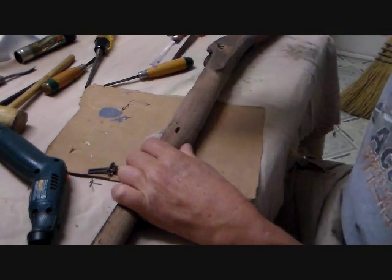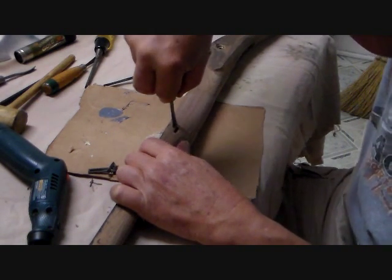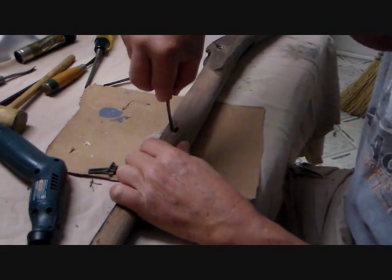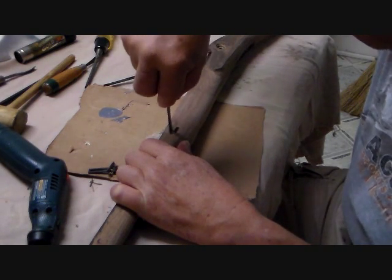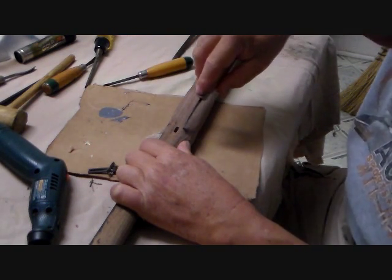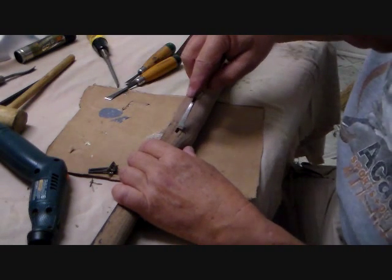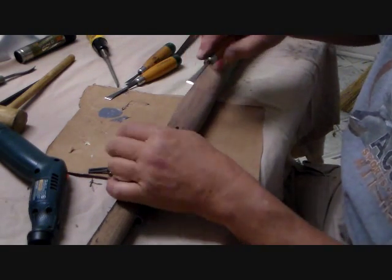And some people think, well, why don't you just put it right up on top? Well, because you actually want it flush with the wood when you sand. And consequently, you have to therefore inlet it for the thickness of the piece of brass. Okay? This stock is also slightly curved. And so you will shape this flexible brass to match the curve of your stock. Okay. So now we sharpen the chisel and we start moving wood.